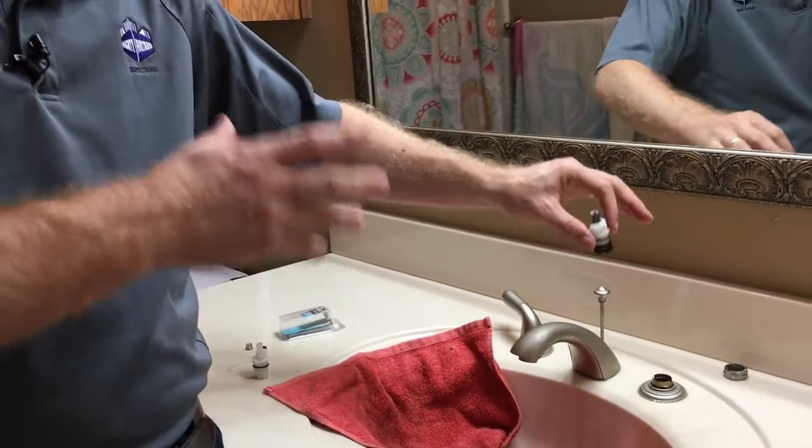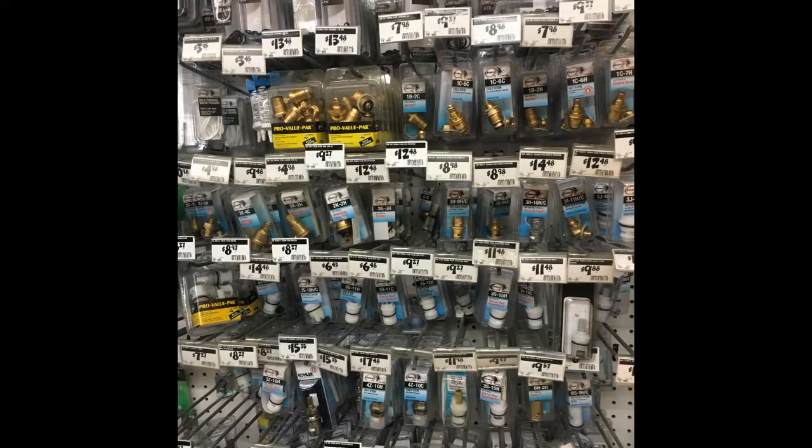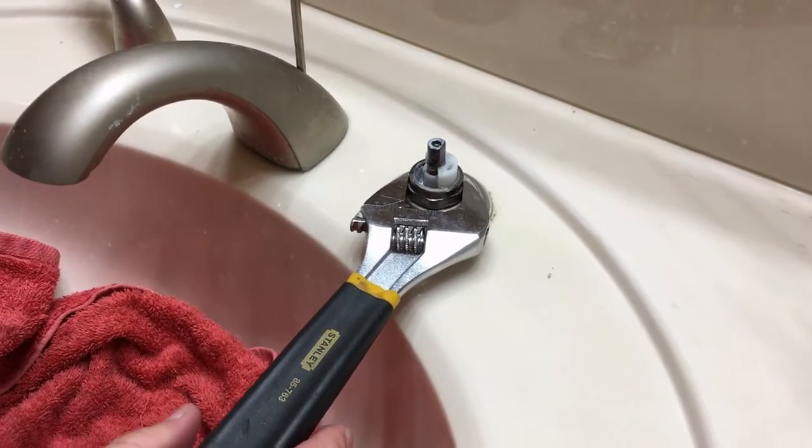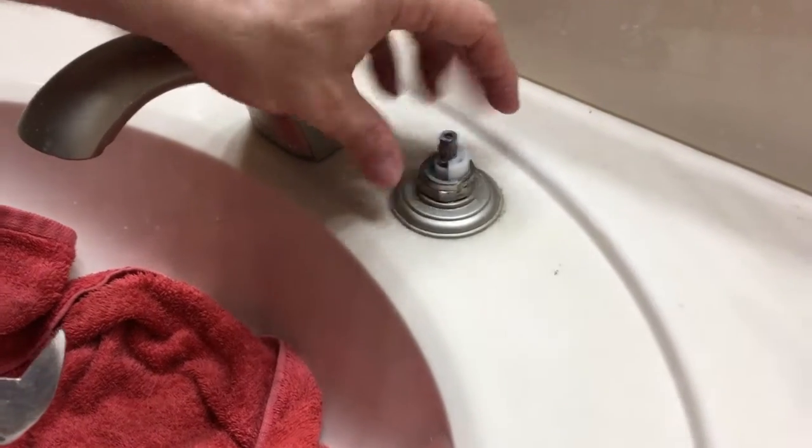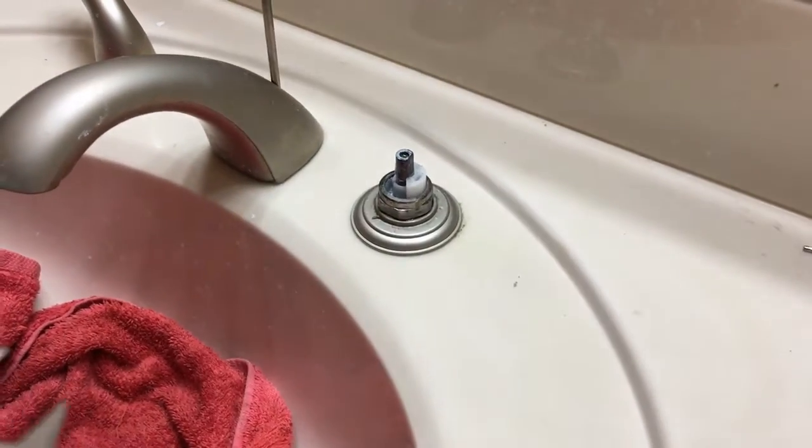One thing to consider in a project like this: this is aged plumbing — about a 17-year-old faucet. Hopefully we'll be able to get it repaired, but there's always the reality that something is just too old and stuck, and if that's the case you're looking at a full faucet replacement. Before you take a part out, make sure you take a picture of it so you know the orientation. Also take the part with you to the store — there are a lot of options and it's nice to have it while you're there. We're going to use a crescent wrench to loosen the ring and pop out our cartridge or stem.